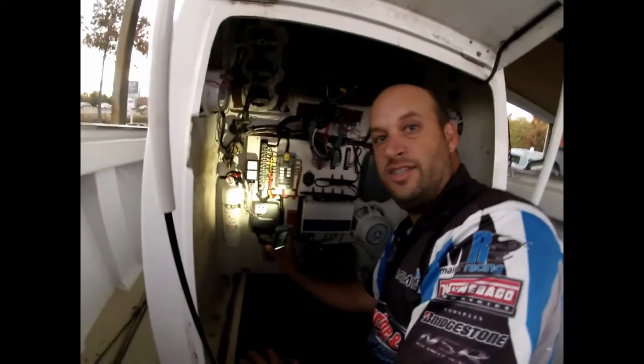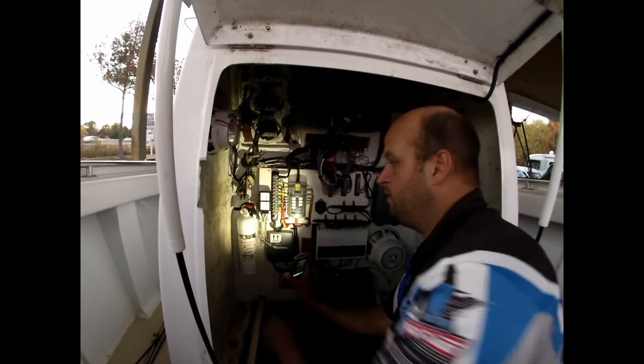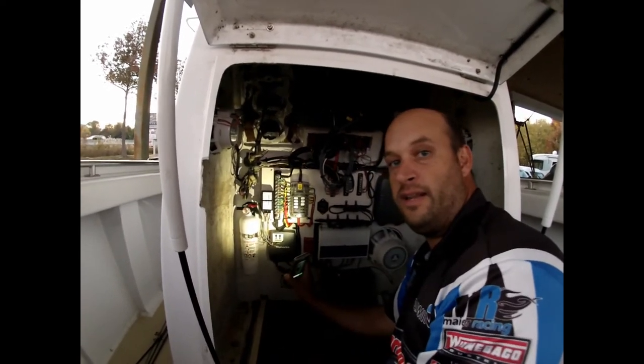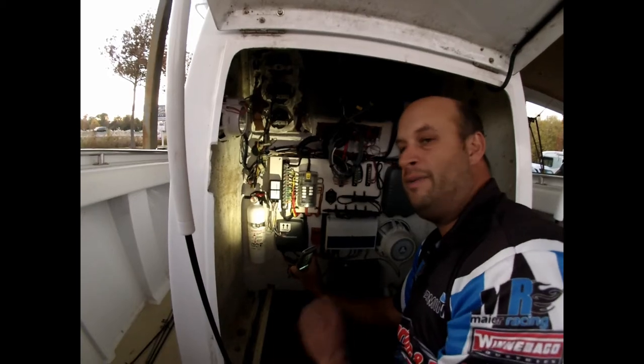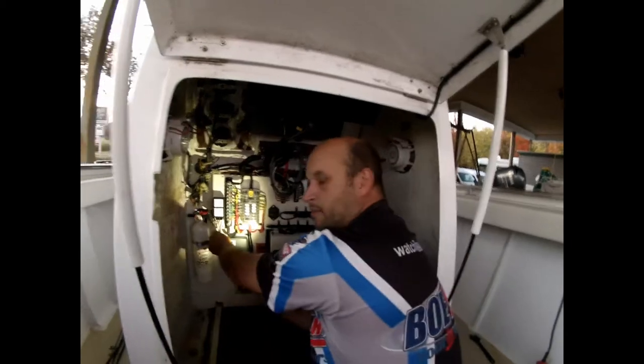Our installation is now complete on the Boat Command boat monitoring system. Here's the module — we have the wiring harness plugged in and it's connected to both batteries independently so it can monitor both batteries. We're going to leave these pigtail wires hanging loose and exposed for now, because in our next video we're going to connect them to the bilge pumps and some other things on the boat, but we will secure those.